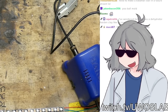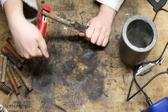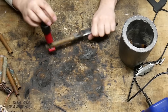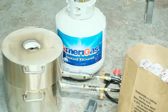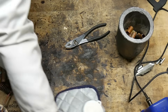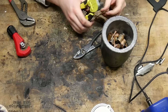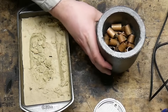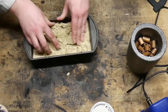We should chop these pipe pieces up to make them melt better. Some drink cans are aluminum but they're using tin-coated steel — I can't even melt steel in this thing. My furnace ain't hot enough. The balls are done. Give me one second, I'm gonna go get them out of the oven. There we go — it's gotta cool, but it is nice and hard now. You know what's been kicking around down here for weeks? It's the sand we used to cast the YouTube button. We're gonna use the same sand to create our ball cast.